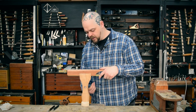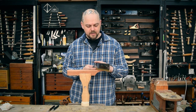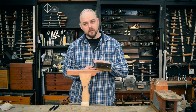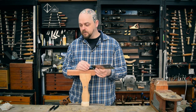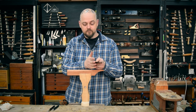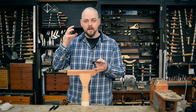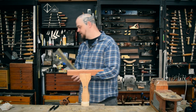It is done. If you've ever sharpened anything before, the principle is basically the same: if you can see a white line at the tip of whatever you're sharpening, it's not sharp — that's rounded over and blunt. We've removed all of those white lines and resharpened it. If your saw is in much worse condition, sometimes people would take a leveling beam and flatten the tips of the teeth so everything is level and then start again — but that's not what we're doing here. This is taking a relatively new saw and keeping it that way.